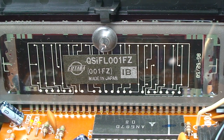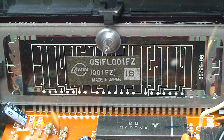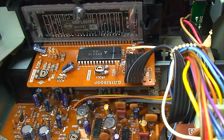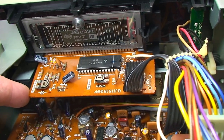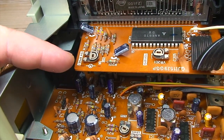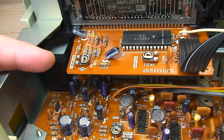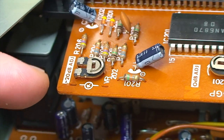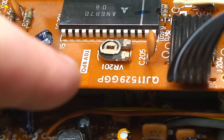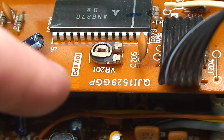Could very well be wrong — I'm trying to read that through the LCD screen of the camera. Made in Japan. We've got this board kind of hanging off of it, a little cattywampus. And it looks like there's actually an adjustment here for setting the sensitivity of the level meters, with a negative 20 dB adjustment and one right over here for 0 dB adjustment.